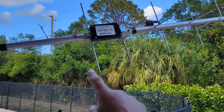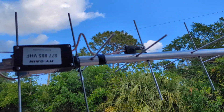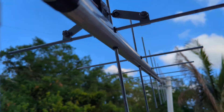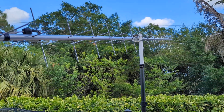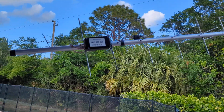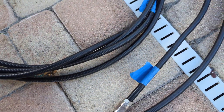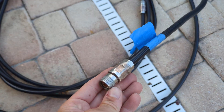So you see - reflector, driven element, reflector, driven element - and they basically attach like this. You could choose right-hand or left-hand polarization. I'm going to be using this for EME moon bounce on JT65 and 100 watts. People asked about feed line - this is 7/8" Heliax, 7/8" hardline, with some really good connectors on here.